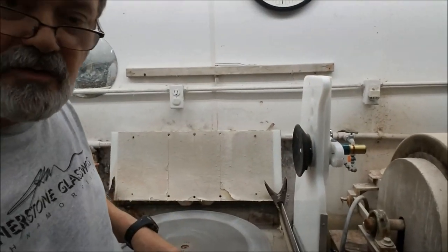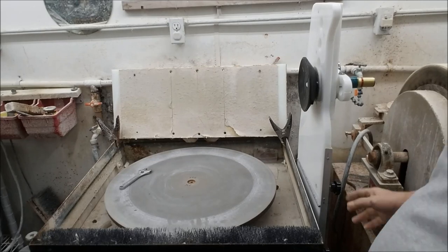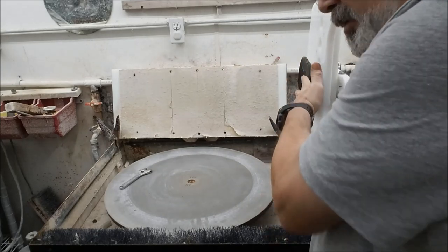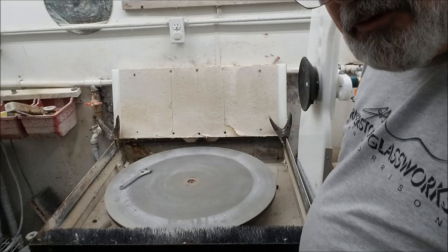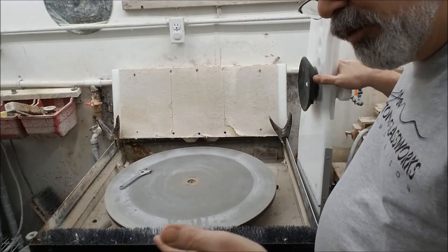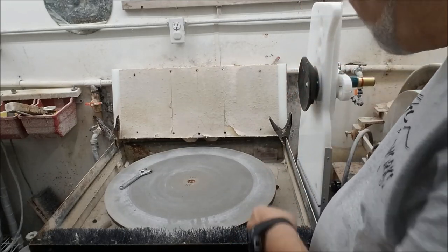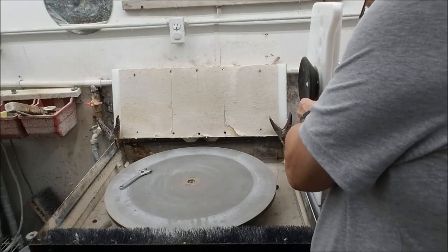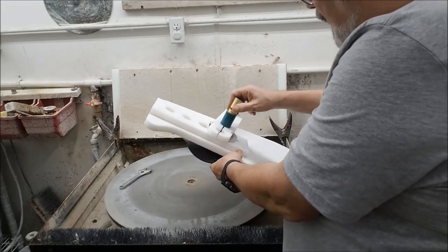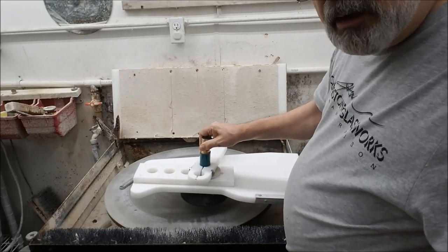I'm going to change the position here a little bit. So anyway, my glass is still attached. Now the one thing you don't want to do is attach your glass and then expect to leave it there for a week. This thing will very subtly bleed, and it'll let go of that piece of glass in a day or two. So you want to keep working on it until you're done with that stage. And in a worst case scenario, as this cup gets older and starts to bleed faster, anytime the plunger's all the way in, it is stuck. But once you see this red line, it means at that point you could lose your suction. So you just pop it again, and then there it is.